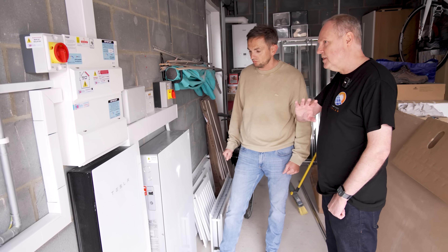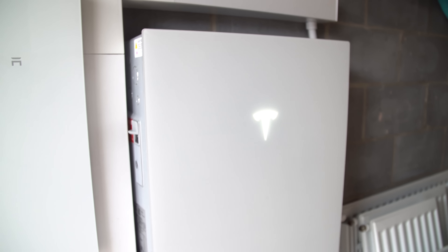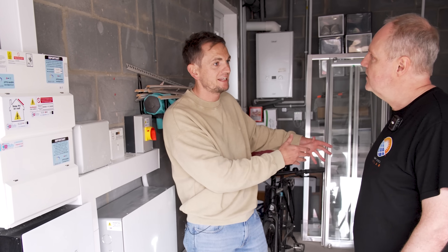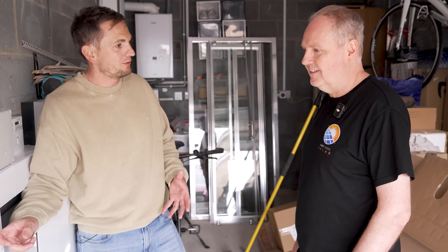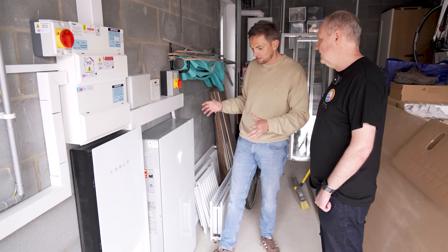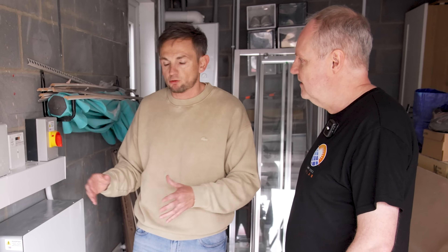Enphase reduces the amount of equipment as well, doesn't it? Because you've just got the Envoy — that's the brains in that box there. And the only connection to the battery is this AC cable here. There will be data coming from the battery as well to go around the Enphase, because you want to give the battery eyes on the solar. Aesthetics are important as well — we've got to try and keep it neat. I like it, it's very neat. I quite like it when as much of the wiring is hidden as possible. I like the fact that you chose a Tesla, especially because he's got a lot of high energy use appliances in the house. He's adding air conditioning and this thing can pump out 11.5 kilowatts. He's thinking about a heat pump, that's going to increase his demand. We've got the gateway, so if he gets any grid issues and wants to come off-grid, it will keep the solar pumping. That's the design thesis — making it look right is really important, but designing it equally is important. Do you want to come see the panels? Yeah, let's have a look.